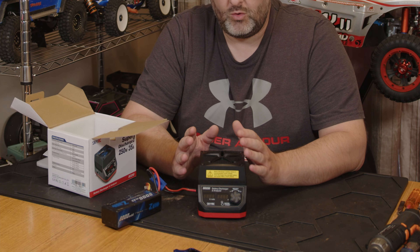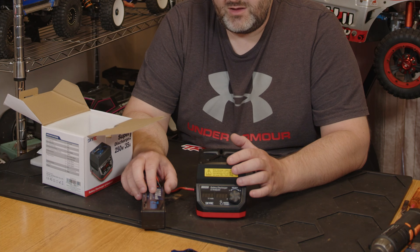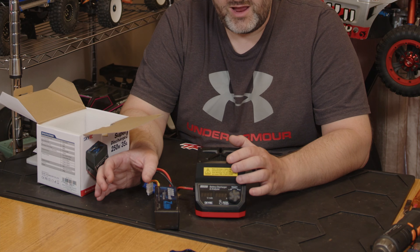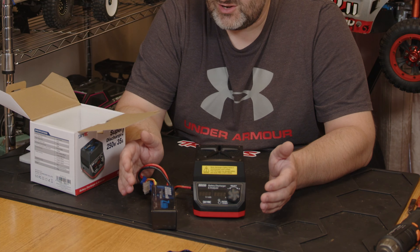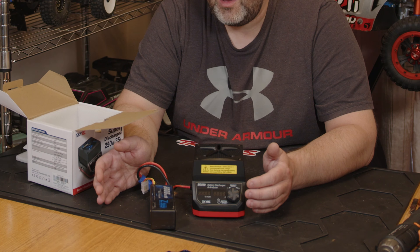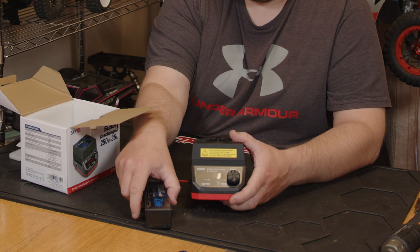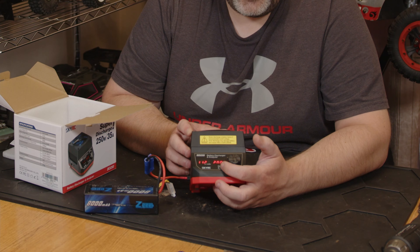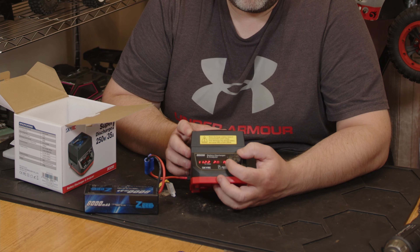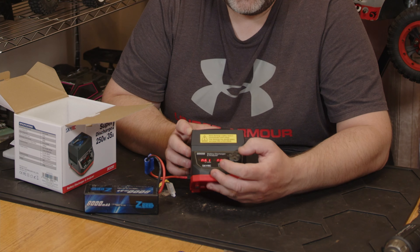You'll get a full readout of the performance of that cell. This is useful if you've got some cells you want to compare — say you bought some packs rated at 100C and some Gens Ace rated at 80C. You may find the cheaper battery isn't rated as high and the voltage drops off quicker. We've got a whole lot of batteries and we're going to run them all through. Basically you plug your battery in, you don't need the balance lead, you press the button to power it up, it'll flash on the amps so you can set the amp draw you want, then you press the button to go to the voltage — the cutoff voltage. I don't like running my batteries down below 3.3 volt per cell.